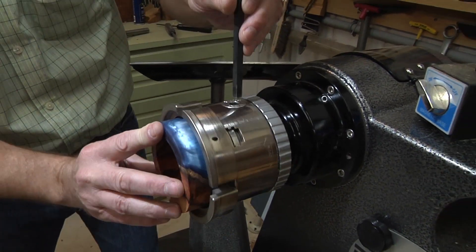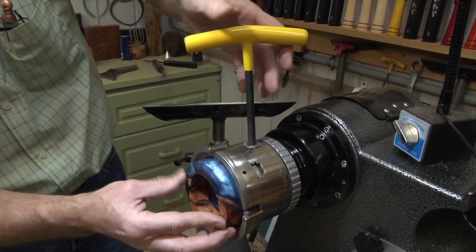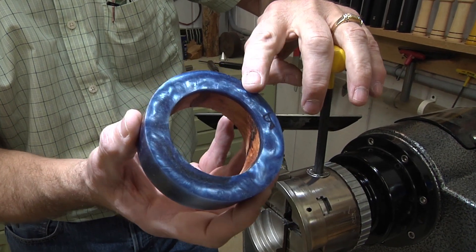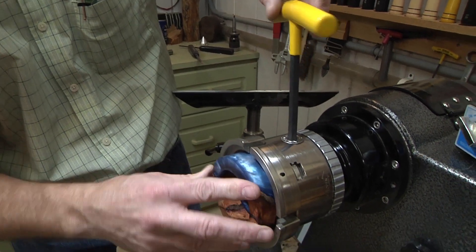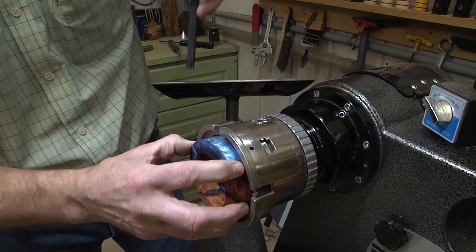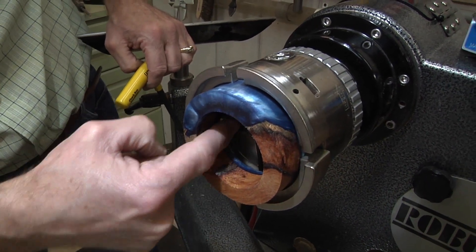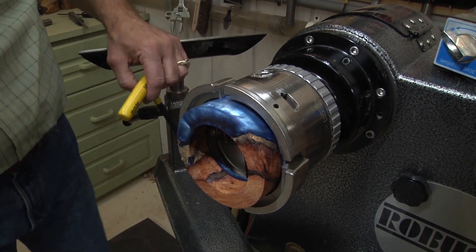I'm going to gently tighten this. I'm holding it flush because this is a perfectly flat surface - when he made this, it's perfectly flat. So I don't have to worry about this going in crooked because it's going to butt up right there. Now it's a good solid hold. See how far my finger's going in? I'm not hitting any metal until I go way past this edge. So I can come in here and do the diameter in one shot and take it off. That's what we're going to do next.